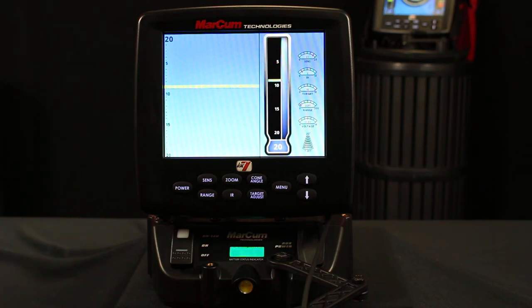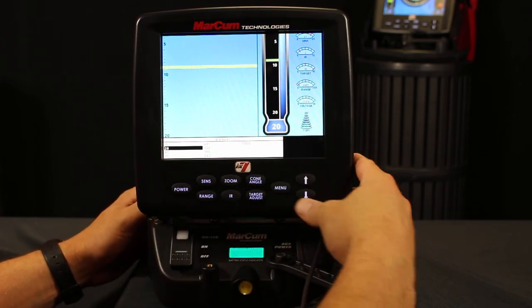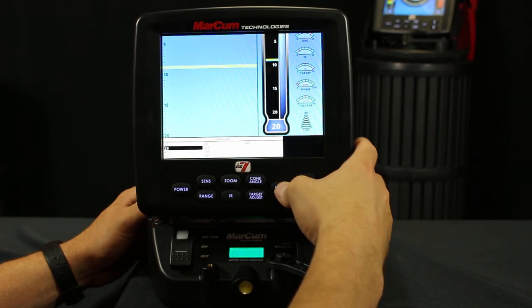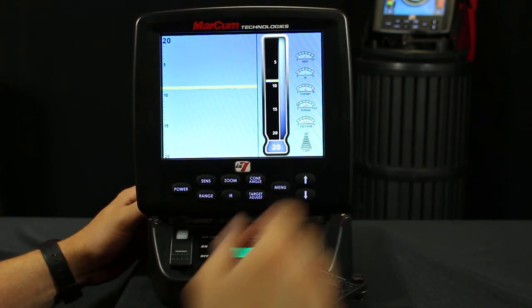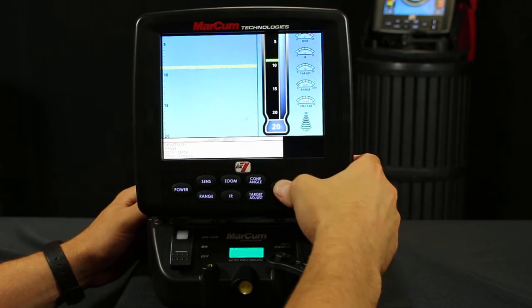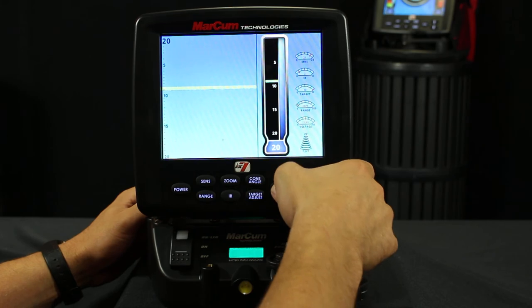It's not going to be exact because it depends on how high the transducer is. A few things I want to set up first to ensure a good test: I want to make sure my range is set to manual range mode and I want to be in a 20 foot depth range. I'll go ahead and enter that. I also want to enter my menu, go down to sonar settings, go to sonar mode, and make sure it's in gain one for this test.